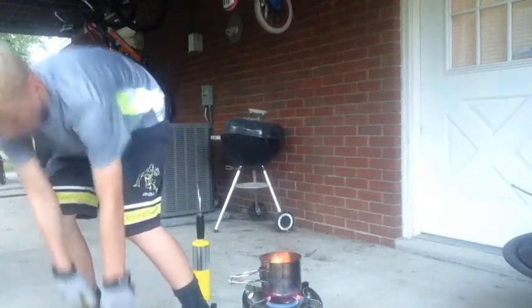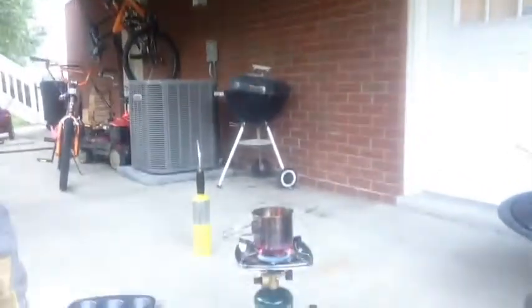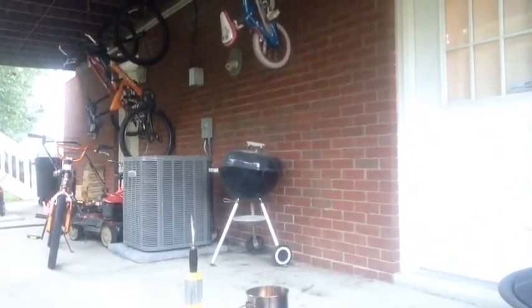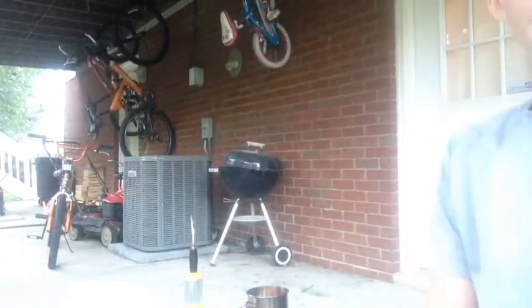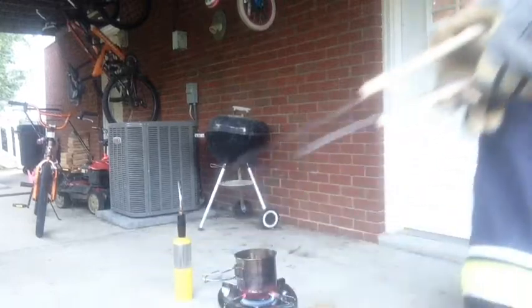So I will show you what the slag is really just going to look like. That there is the slag that I got out. It's still stuck onto the spoon a little bit. But as I said, you just blowtorch that and scrape it off. It'll come right off. That's just like the coloring coat and that kind of stuff. But you do not want all that in there. If you want, you can leave some of it in there. It does help a little bit when you pour. It is sort of like a filter almost. It filters a lot of it out, and it keeps the metal pretty darn pure. But that's why I did leave a little bit in there.